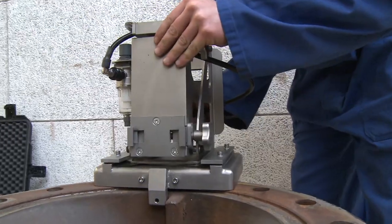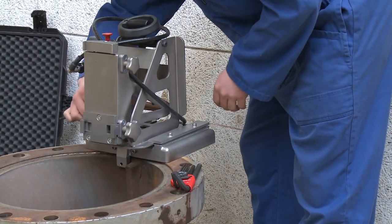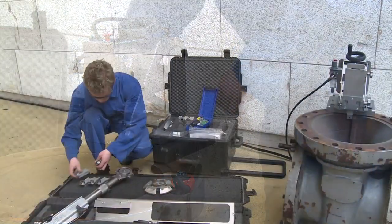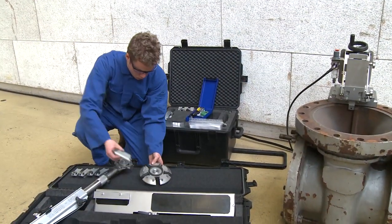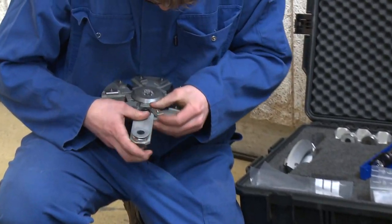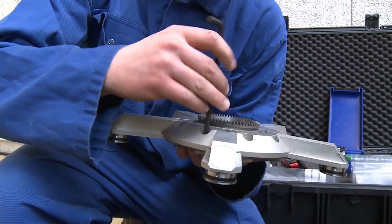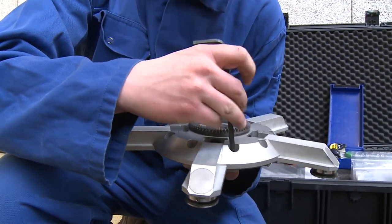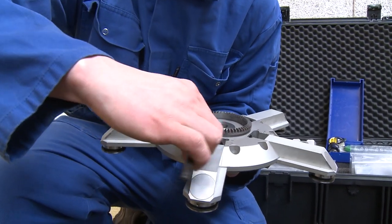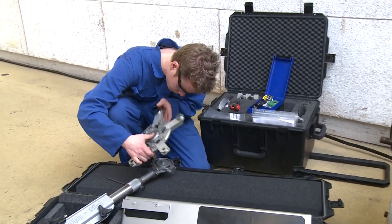The combination of the stainless steel base and adjustment brackets and the round-shaped machine arm allows clamping in any position on any type of valve bonnet. In case of reconditioning a gate or parallel slide valve, the adjustment brackets remain in the same position, and only the arm is simply unclamped and turned 180 degrees for machining the opposite seat.